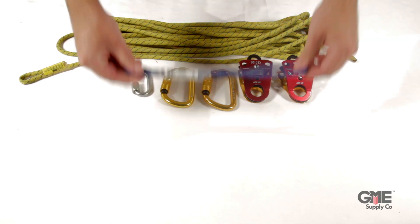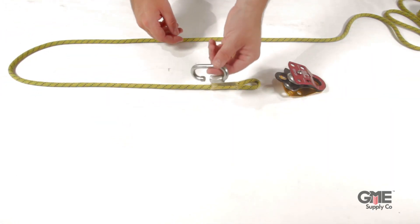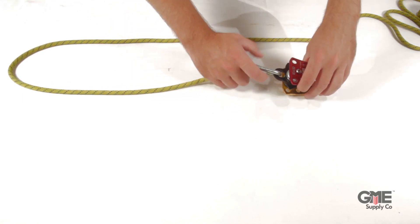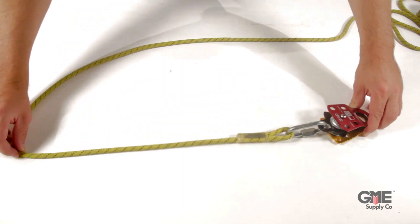While it arrives disassembled, it's one of the simplest haul systems to set up. First, you want to lay everything out on a table or workstation and give yourself a couple feet of the 8mm rope to work with. Now, take the quicklink, the terminated end of the rope, and one of the double-sheave pulleys and go ahead and connect those. And since we're done with that section, we can go ahead and lock the quicklink.